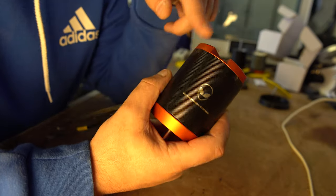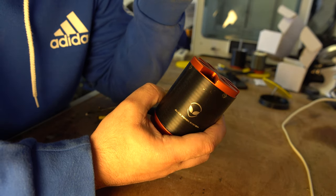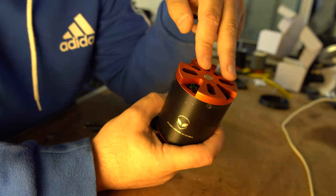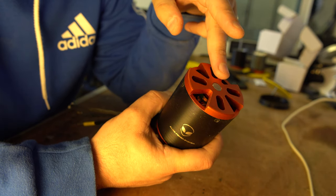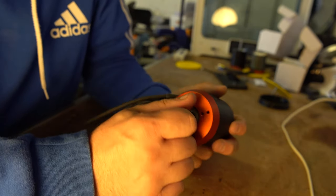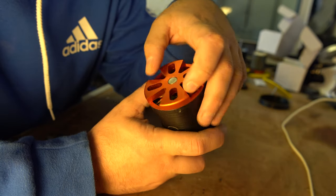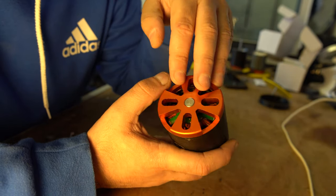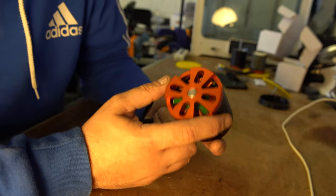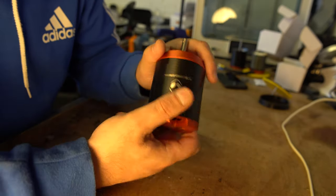The basic operation: signals are sent down these wires causing a magnetic field in the stator which attracts and repels the rotor, making it spin. Compared to brushed motors, BLDC motors are more efficient, they don't have parts that wear out beyond the bearings, they're less electrically noisy, they can sustain much higher RPMs, and it's a lot easier to get rid of heat. That's the main reason we've all switched over to these.